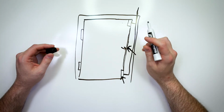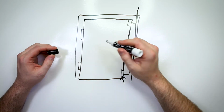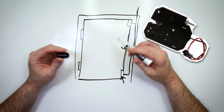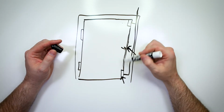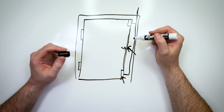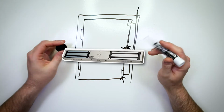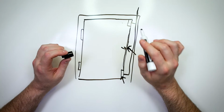So just plan ahead for where your Maglocks are going to go and how they're going to go, and even whether a Maglock is the right thing. Like some smaller props I've seen, a cabinet lock would have been a better choice than a Maglock. Also, if you really need a lot of holding force, there are double Maglocks, which have a lot of holding force. Again, a little bit of pre-planning saves you a lot of headaches down the line.